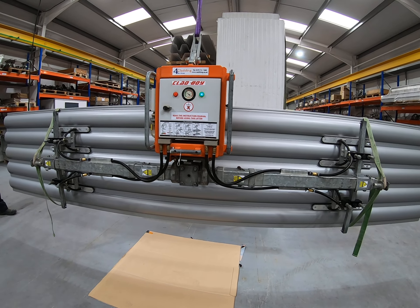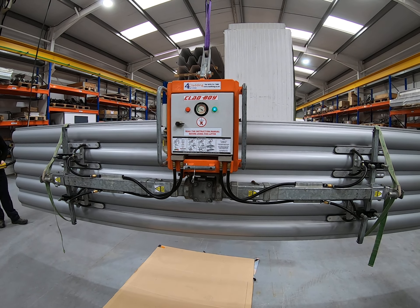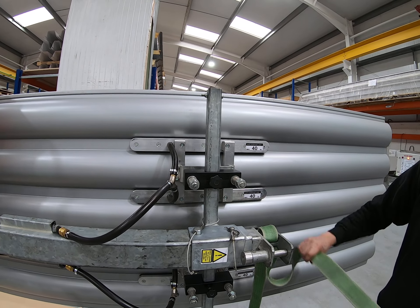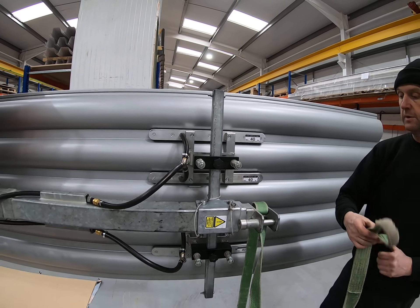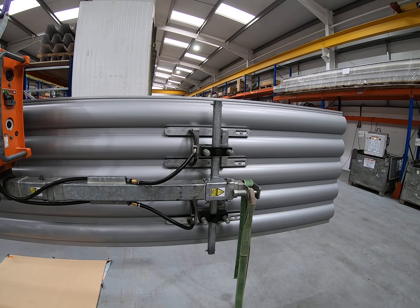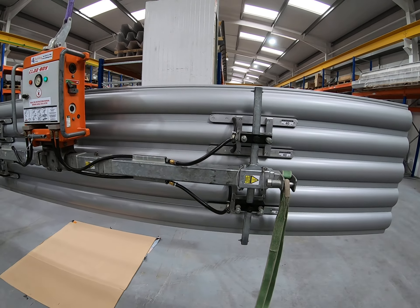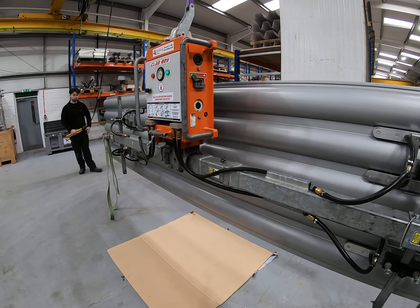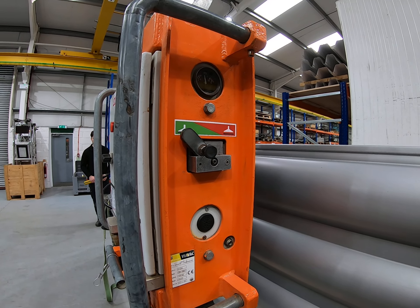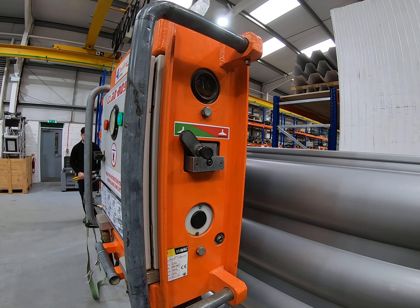On site, you continue lifting the panel and present it to the wall. When you're a few inches away from placing it, you can release the safety straps by pulling the pin and throwing the straps clear of the panel. Continue those last few inches, position the panel where you want it on the wall, and then secure the panel before you release suction. Make sure the panel is secure against the wall, then release suction by pulling the pin and rotating the lever into the red position — the panel will be released. Don't do that until the panel is secure.